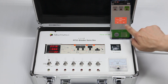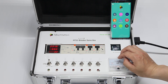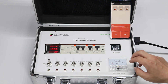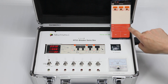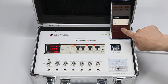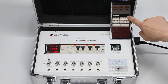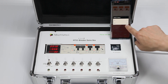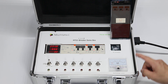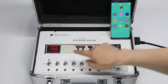You will also get feedback when you switch on. Now let's do the Eye Timer demo. First, choose which breakers you want to operate, then choose once or daily — let's choose once. Set the time: year, month, date, hour — let's take five minutes. We want them to switch off, so save it. We've now generated a timer task. It's currently at 50, so in another four minutes it will switch off altogether.